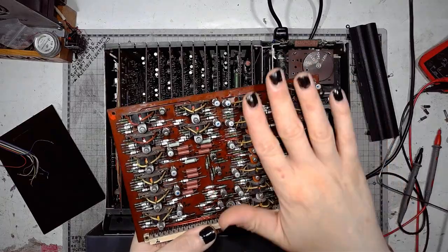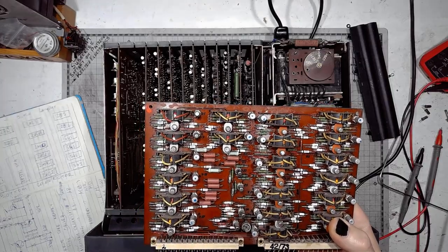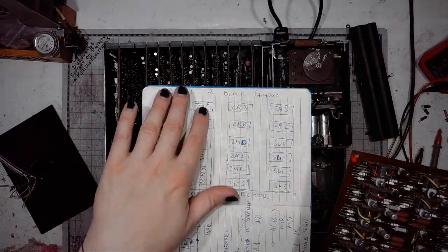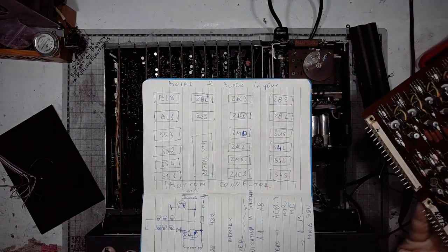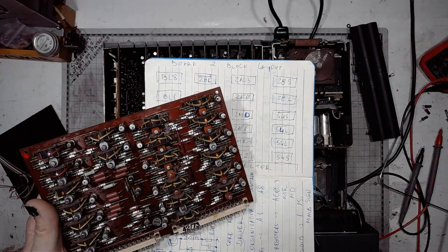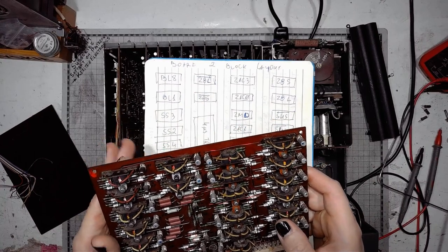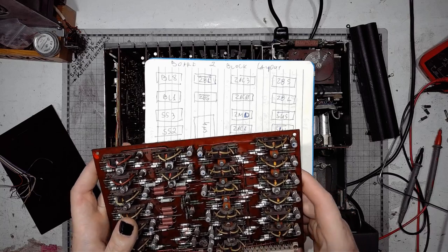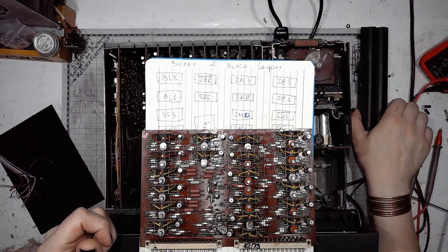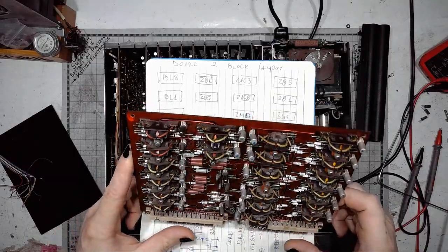There's a lot of control amplifiers, and in order to fix the calculator, I had to map all the blocks from the schematics to where they are found in the board, because certain symptoms would be characteristic of read circuitry or write circuitry. It would be characteristic of a particular part of the ferrite core memory or the control circuitry.